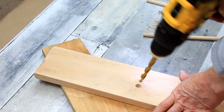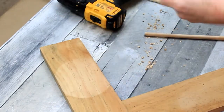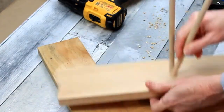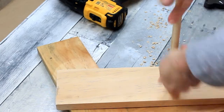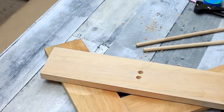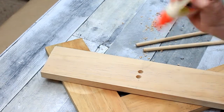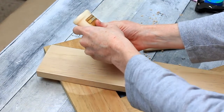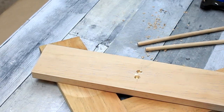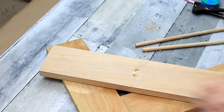I'm going to drill down but not all the way through — that's why you see me drilling slowly, so that we still have a solid back. I'll knock that sawdust out and use my sanding block to smooth it a little. They fit in there and stand up straight even without any glue. Then I'm going to take my wood glue — I believe this is Elmer's — and put it down in both of those holes, swirling it around so it's touching the sides and the bottom, and just clean it up a little bit.